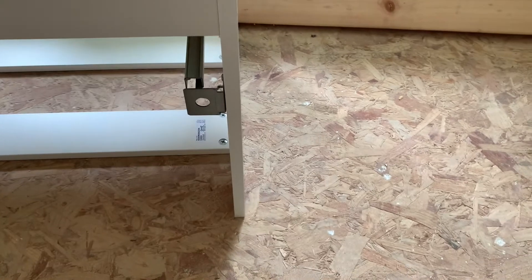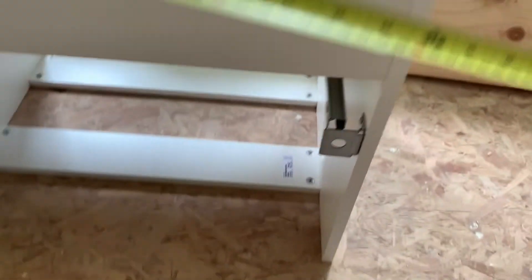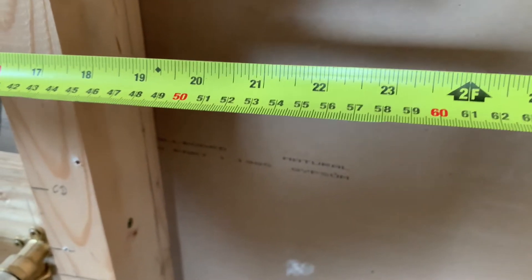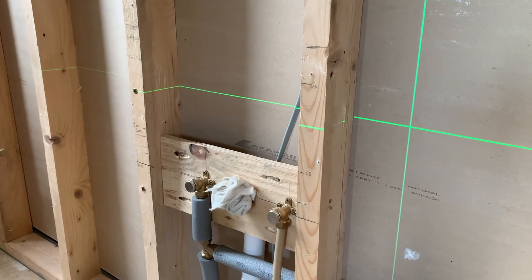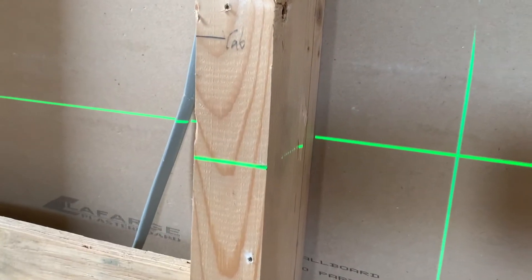The distance from here to there is 52. By rough measurement that will take me right between the joists. So 52 centimeters from the zero point brings me here - and this is where cross timbers will have to sit between the studs. One here, one further down to make a line with this one, and one all the way up there. The laser is giving me a nice self-leveled line across the timbers, and I've made a pencil mark - that's where I need to put in a cross timber reinforcement.